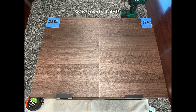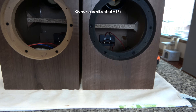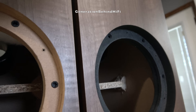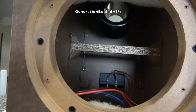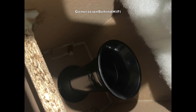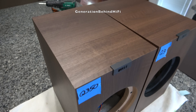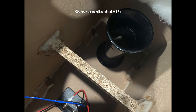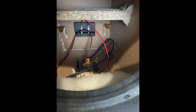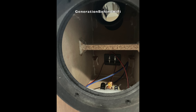As far as I can tell, the cabinet between the Q3 Meta and the Q350 are identical in construction and design. The front baffle is 1.34 inches thick — one of the thickest I've measured in this price category. The rear cabinet wall measured 0.59 inches thick. KEF has included a single brace in the center of the cabinet tying the two side walls together to help with cabinet resonances. Even the bass reflex port is the same length and diameter — 6 and 5/8 inches long with a 2-inch diameter — and flared on both ends to prevent port noise. KEF uses two rolled-up pieces of damping material placed at the front of the cabinet, one at top and one at bottom, with the rest of the inside walls bare.